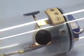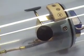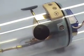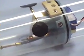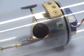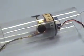When I move the left-hand stick to the right, it engages the blow valve. The blow valve opens, discharging propellant into the ballast tank and discharging the water, surfacing the boat. Normally, the stick being spring-loaded is in the center neutral position — both the vent valve and the blow valve are shut.